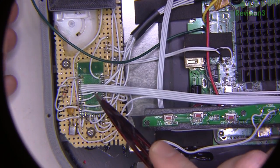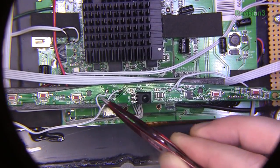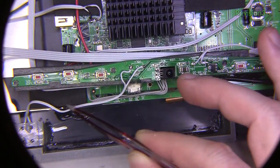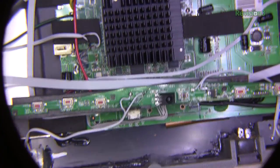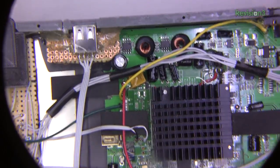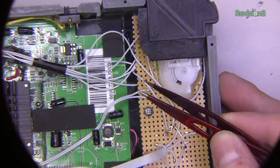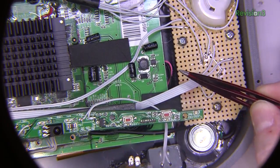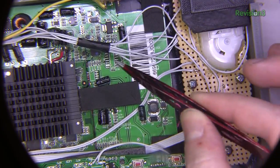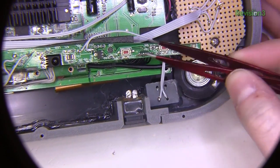After a few hours of soldering, I have the controller all hooked up. Here's the Bluetooth module we took out of the controller. Here is the control panel for the LCD — we've wired up a couple of the buttons to the front face, specifically volume up and down. Here is the OUYA and its heatsink. Here's an external USB connector connected to the OUYA. We have the other controls, and I tried to put those all in one ribbon cable — there's ribbon cable here and here to connect the two control halves together. The speaker is down here and here's one of our volume buttons, and here's our charge jack.